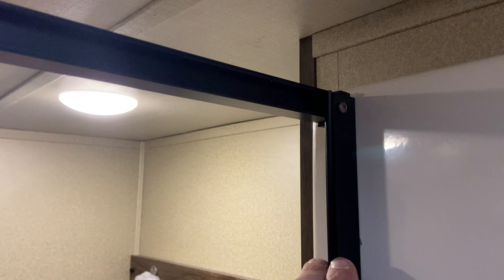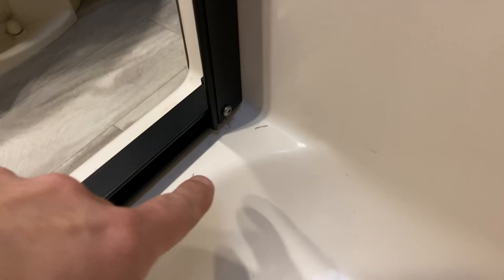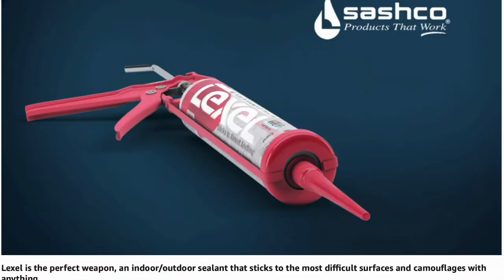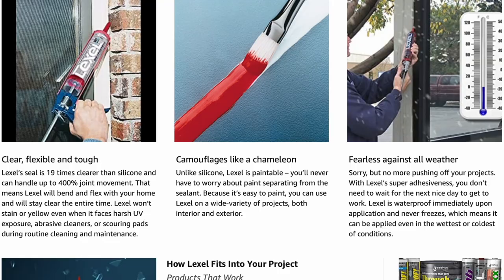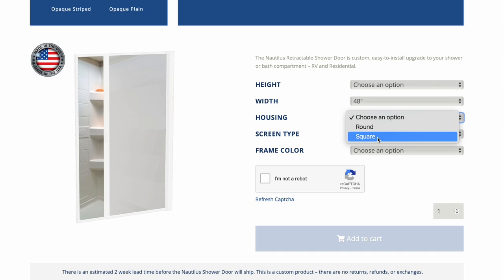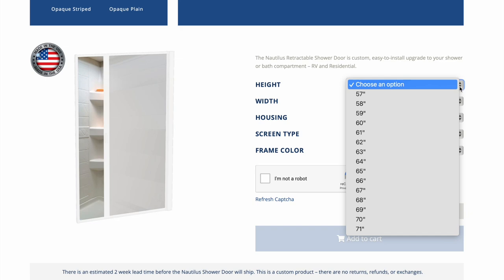Okay guys, the project's finished. Cut the top bar and bottom bar to length. There are little white tabs on the door that you pop into the track up top — once those are in, don't forget to put your set screw in both top and bottom to hold it all together. We still need to caulk all around it. The instructions say to caulk only the outside, but I'm doing the inside too — otherwise water gets behind everything and builds up underneath, same nasty problem as before. I'll use Lexel caulk, which I like a lot — I'll put a link below. These come in a few colors and models. Expect about a two-week delivery time and note they don't do returns, so measure carefully.